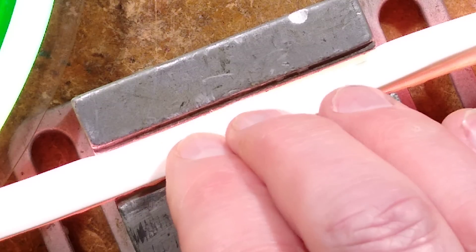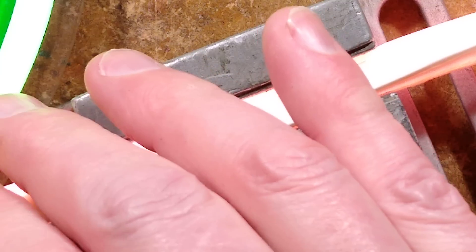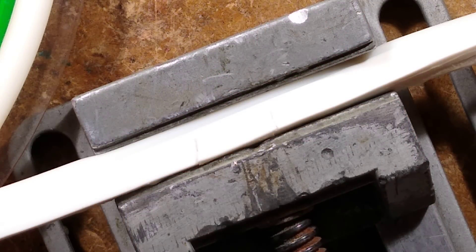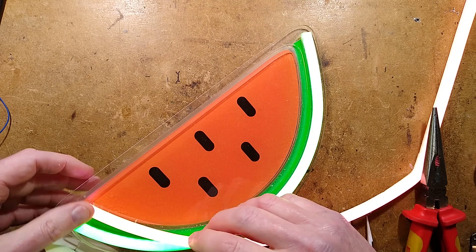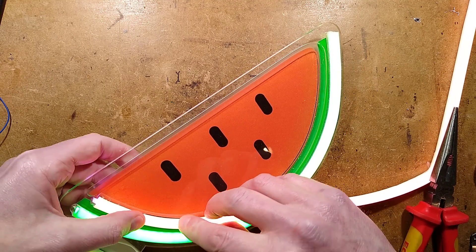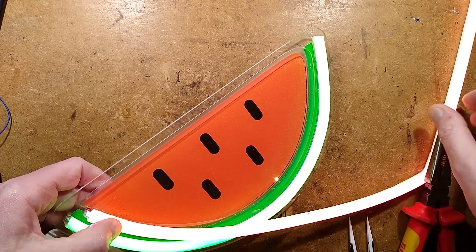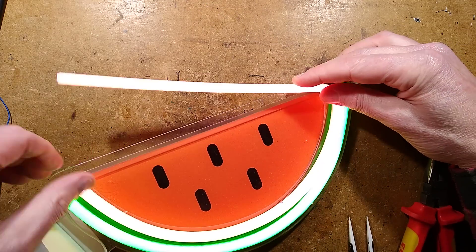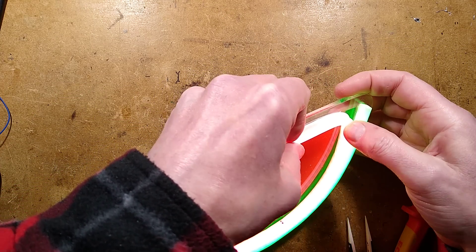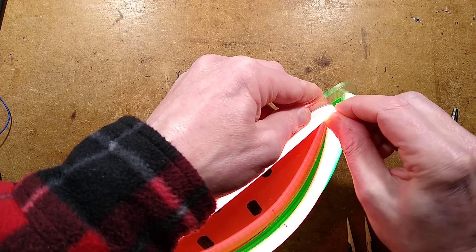It is lighting evenly now and it's staying lit. What's the chance of me getting this back into the frame easily? I'm going to try and put this back in. I notice the LED is now popping out the end — annoying. I'm going to try and squish this in; friction fit. Because that's where the curve is already, I'll pop that in there. What's the bet that as I squeeze it back in, that solder bridge breaks apart? It is where this stuff is very prone to failing.